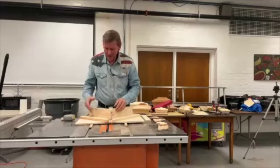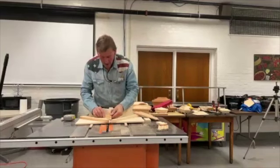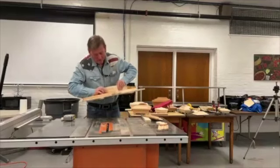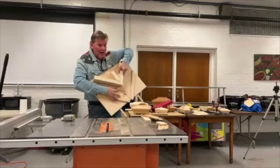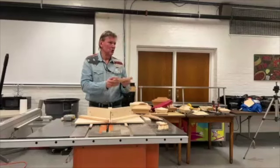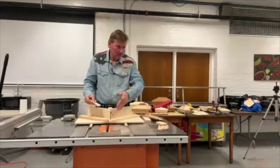Same thing, once you have your depth, you're going to cut them on this side. And again, this is what I meant about not being much smaller than this. When this piece is being cut, this is how much is on here, which is fine. This is enough. Anything more than that, I would put a sacrificial fence back here to support the piece. So in general, try to keep no less than a 5-inch side, unless you want it to meet, in which case you'll have to have a sacrificial fence that you'll have to keep cutting into.